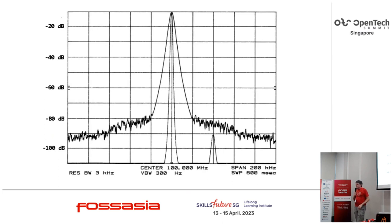Another big one is phase noise. And this is a particularly interesting analysis because of the habit of listening to stuff that's come by the ionosphere and therefore is incredibly weak. So, start with a presumed near pure tone at whatever the reference is, and then a nearby signal, I think this is pretty close to me, that is at 90 dB down. It seems like a very small signal, but as far as I'm concerned, that's huge. You've got off-the-shelf radios that go 60 dB below that.